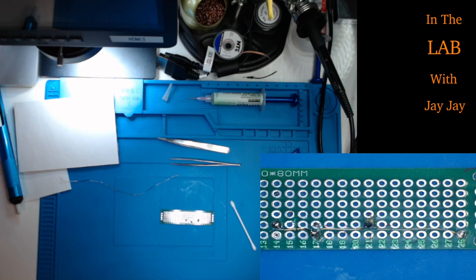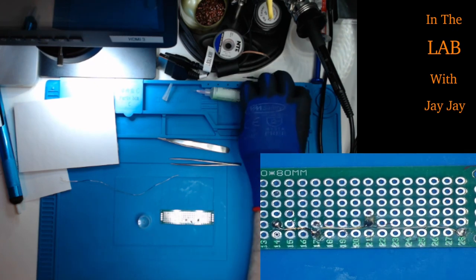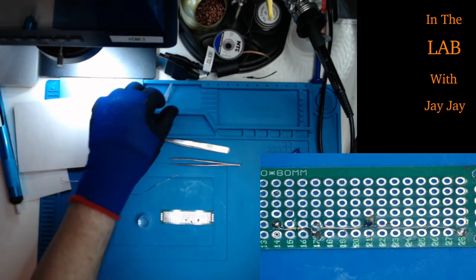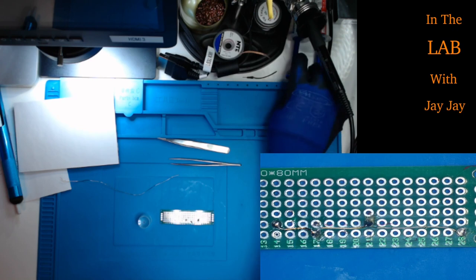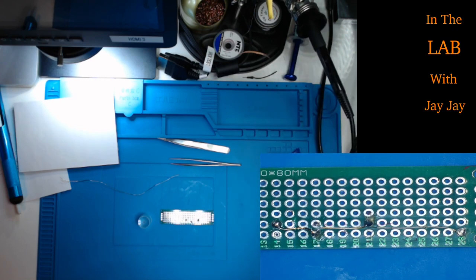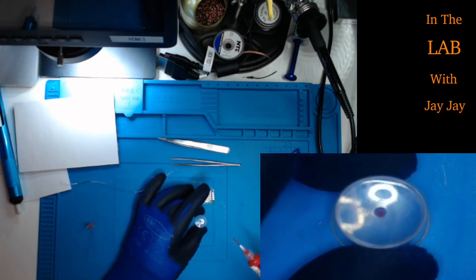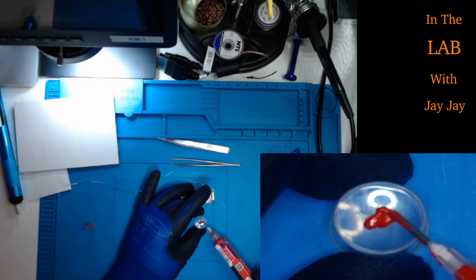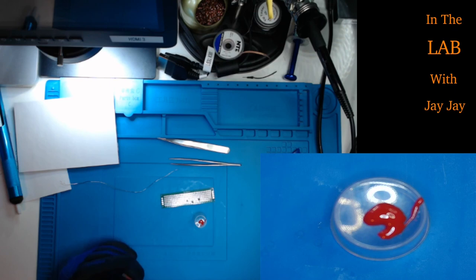Mission accomplished, I reckon. So now we go into phase two of this little exercise, which is to apply the UV solder mask. Now I found that I like using this, this is the cap off my isopropyl. And it's good for holding the solder mask. Might as well turn our iron off. I think that part of our adventure is over. Now we're going to do the solder mask together. So, I wonder, can I show you that? Got this cap, and I just squeeze out a bit of the solder mask. And then I can just put the lid back on him and chuck him away in the corner.